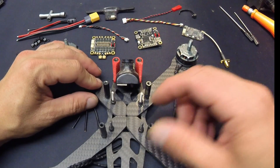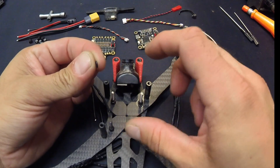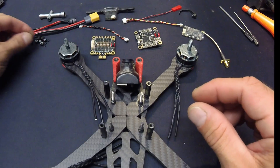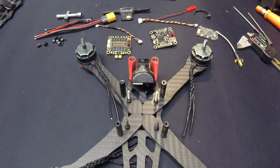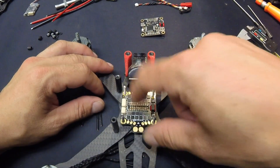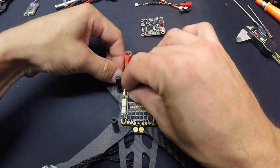The speed control is going to sit down in there. We're going to wire up most of the hard stuff first, then drop it in. It does come with eight small O-rings and I'm going to use them — in my mock-up they make the whole situation float a little bit, which is nice. Very small silicone O-rings. It also comes with included standoffs. So slap it together, solder some wires, have a good time. I like to mock everything up and then do all my tinning of wires first.